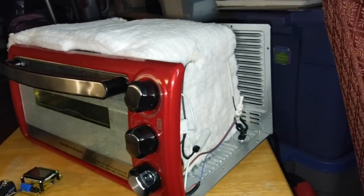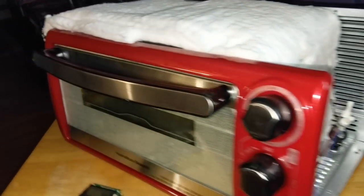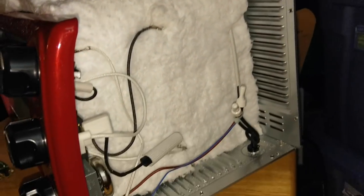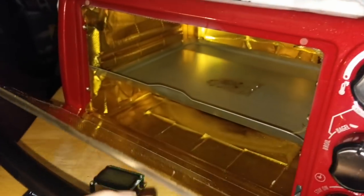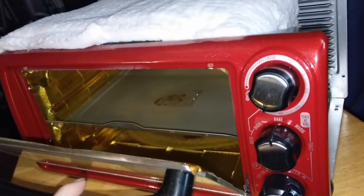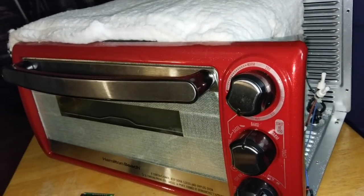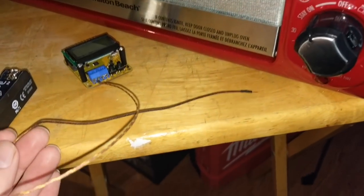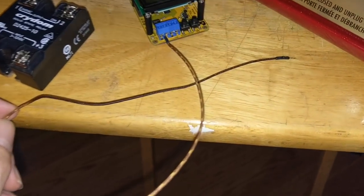We're back in the toaster oven — we've had numerous trial runs. The ceramic blanket is doing excellent — hasn't really fallen apart, burned, or anything. Super awesome insulator. The tape on the other hand has been kind of sucking. The only bad part is up at the top, starting to black, and it smokes if you run it for too long. I've had to run the fume extractor to help with that. You have to pay for the expensive tape — the rolls rated to 850°F on Amazon for about $56, unlike this one rated to only 550°F. The thermocouple from the kit is also starting to turn black.